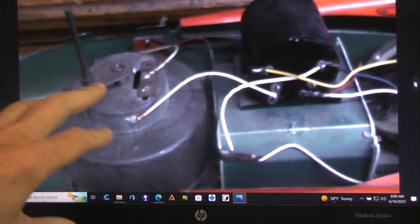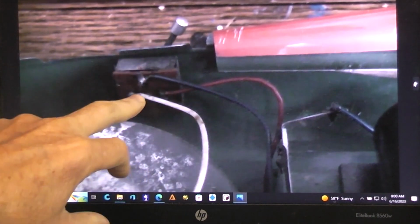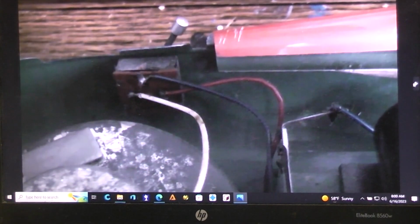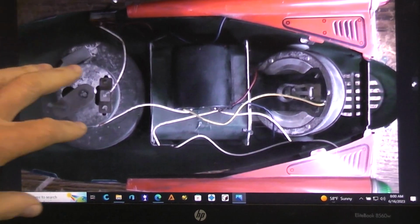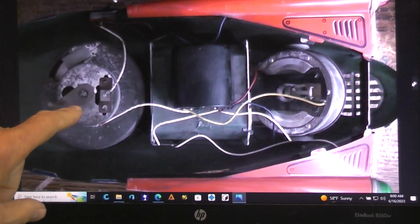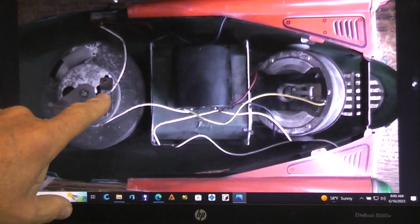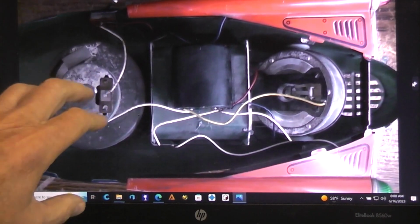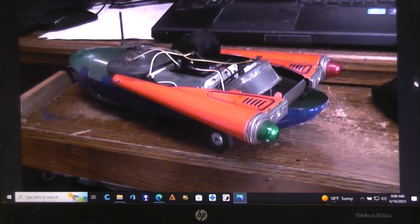Out of focus, it's more of a close-up of that, just showing the inside of the switch. There's something very special about that switch, which we're going to talk about. This is looking straight down onto it. Because the complete motor does rotate, it gets one side of its power from frame ground, but it has an isolated wiper delivering power to that motor right there. And there's a beauty shot to the side.